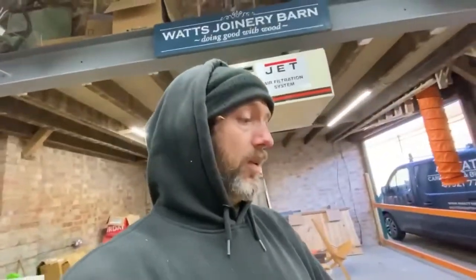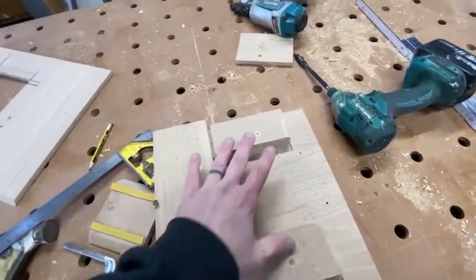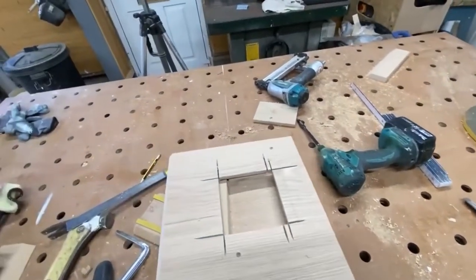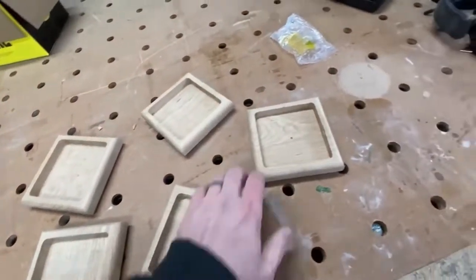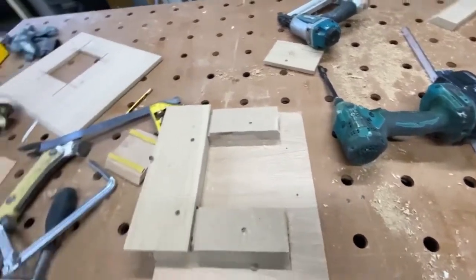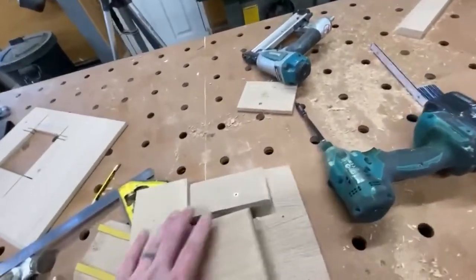Okay, lovely. Right, I just thought I'd quickly run you through the jig that I knocked up there. It's got a bit messy, to be honest with you, because I just smashed those out. But basically, we've got here a jig which holds the piece of oak in place, then a separate jig which goes over the top, which performs this job of housing out each one to sit on the newel, and then we actually reuse that jig to take the side off of it, cut a bit out, and we'll then put our cap in.